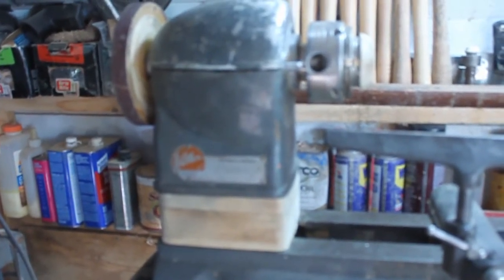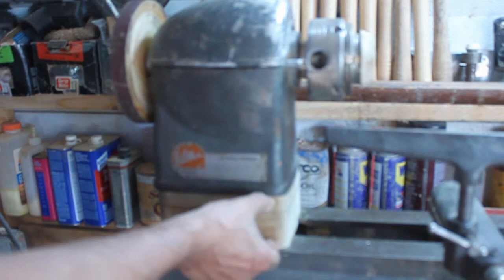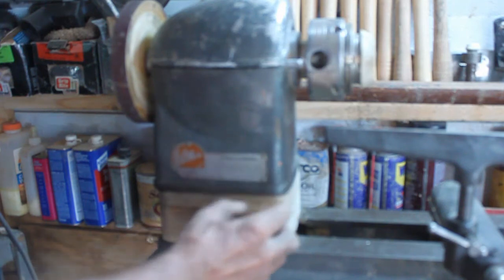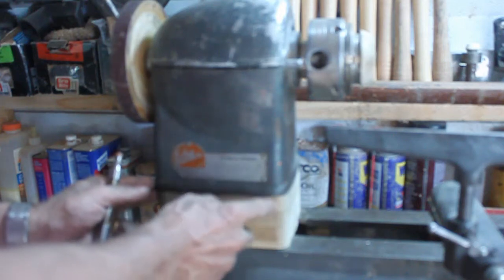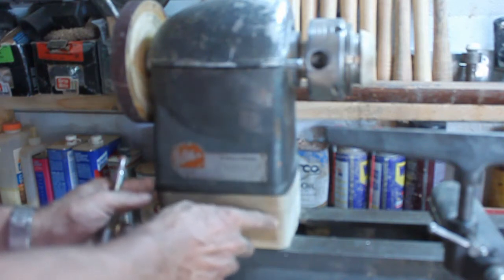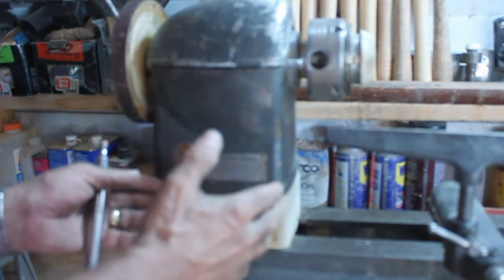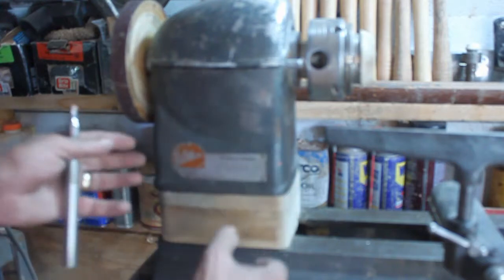I must say, getting the headstock in was quite a project. I had to oversize the two holes going through the blocks. Couldn't get the bolts to line up exactly over on this area over here. So, you know, it doesn't matter how careful I was and how accurate I lined it up from inside, there was just that little bit off. So it took some doing, and I had my wife actually help me hold up the lathe. And the way I finally did it was extend it out, rest it up away from the floor so I could work it upright and from underneath.